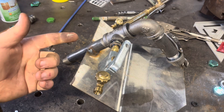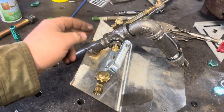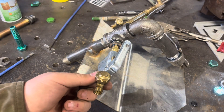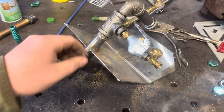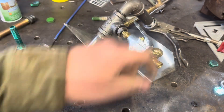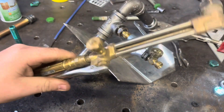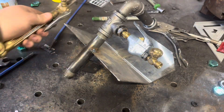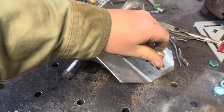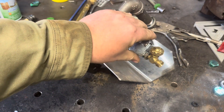Tee fitting — nothing fancy. Oxygen comes in and goes to the tee fitting. Working my way back I've got a three-quarter to half to three-quarter, half to three-eighths, three-eighths to three-eighths, and on the end a three-eighths to quarter, then a quarter to the oxygen fitting. Those astute among you will notice that's an oxygen valve off an old KT Tools torch that's no longer in service — the valve still works. That said, I couldn't find one of these turnstile-style valves on Amazon, but you don't really need it — all you actually need is this Milton blowgun valve.